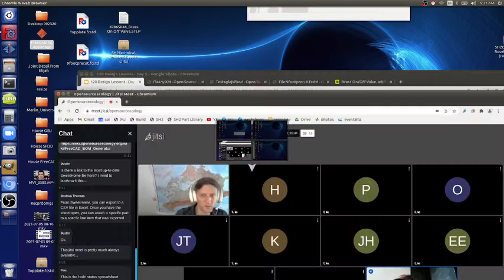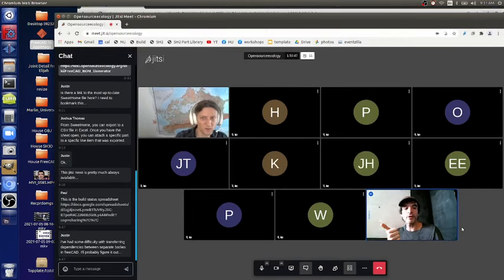Excellent. So any other questions regarding the design of the wall modules? To summarize, you now know how to extract the Sweet Home 3D files and take all the information out of that. However, they're not the fully updated ones. A lot of it is correct. Maybe the blocking is not at the right height, or maybe the corner module. I know the corner modules are missing the nailing board, the 2x4 that's now visible. Do we have that in Sweet Home, in FreeCAD? I think we have some of the corner modules in FreeCAD, but there's definitely more to be done there. You can use the conceptual model, the technical model in Sweet Home for overall orientation and general picture. A lot of those details are correct, but just not everything, because some of the walls are already updated.